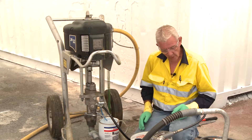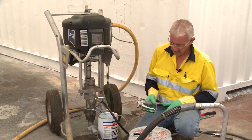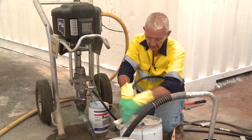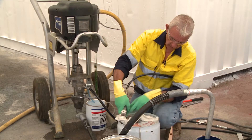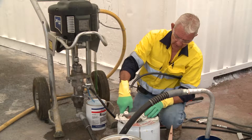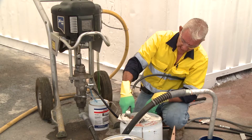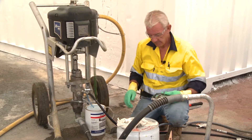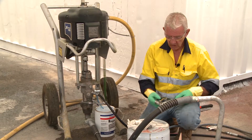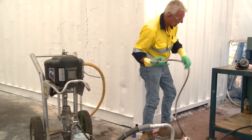That's more than enough — that's the appropriate way to do it. I don't raise the regulator pressure until I have paint coming out. Keep your hands clear, utilize the safety, and put the gun over the hole with a piece of rag around it — safety off, depress the trigger. This lets me watch the end of the gun from a safe distance with safety glasses on. I've now flushed the solvent out of the lines and I'll save that solvent for the next flush when I finish painting. I also need to recirculate the product slightly to make sure what's in the tin matches what's in the gun.